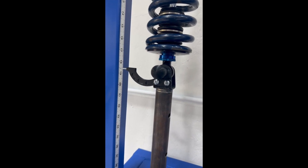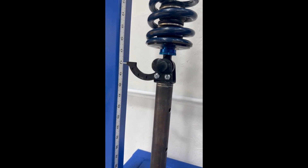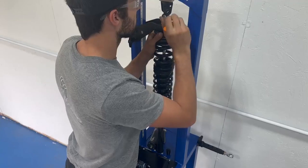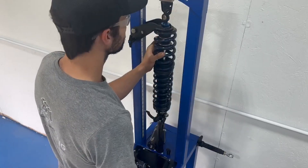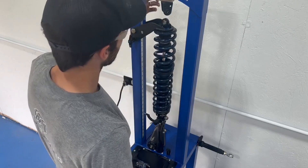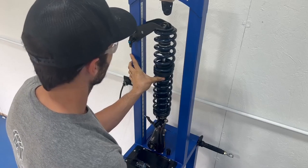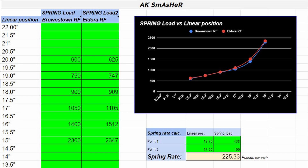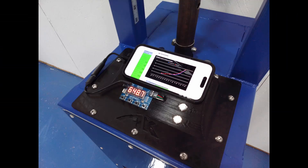I then cycled the machine just to make sure that everything worked. Next I confirmed the spring unloader attachment worked — it was designed specifically for Bilstein shocks but will probably work with other brands that use a similar snap ring style bottom spring perch. Lastly, I made a spreadsheet that allows me to graph my spring loads, just so that I can say my spring smasher is a touchscreen graphing spring smasher.